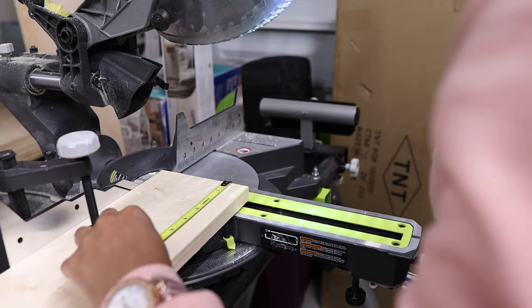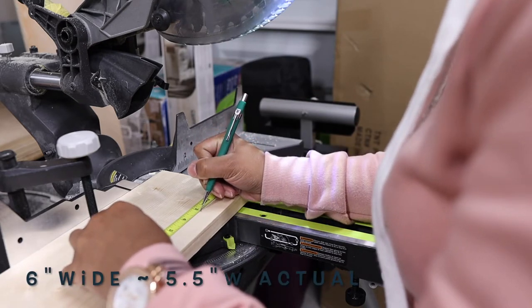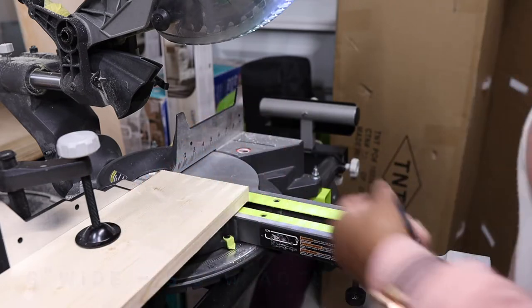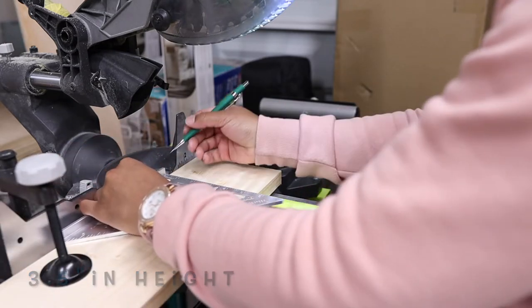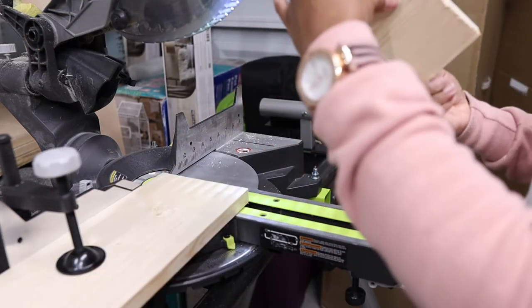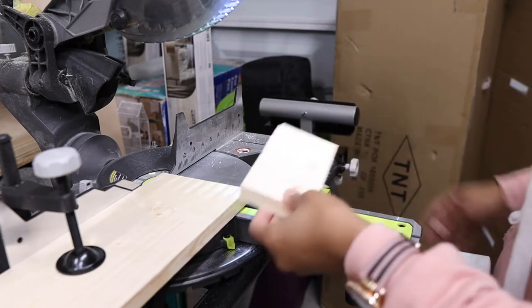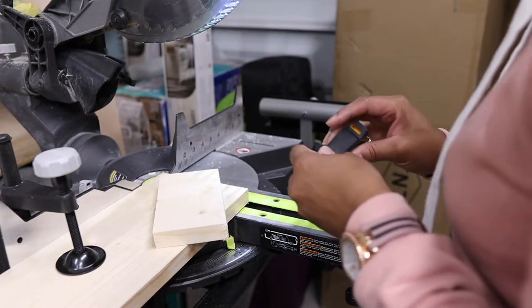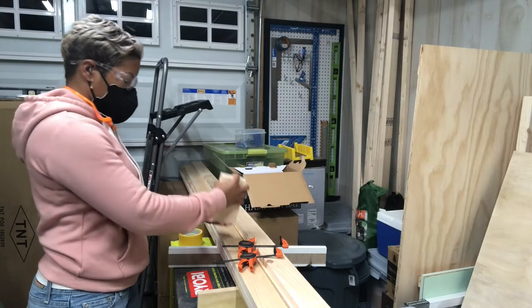The pieces making up the bottom that catches the bottle caps — the wood is six inches, so really five and a half. I did those pieces at three and a half inches, so there'll be three pieces that form the U shape, the bowl for the bottle caps. Then I'll have a long back piece that I had to do some improvising on to fix because I didn't have my measurements correct, which is normal — I'm teaching myself this as I go.